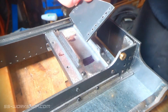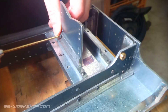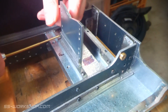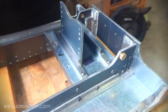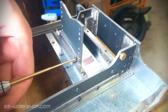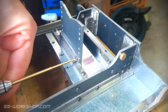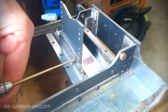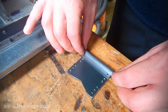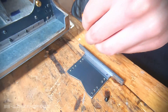The hole is complete, it's time for assembly. I've already bolted the frame in here and there's a piece of 0.5mm galvanised steel fixed to the underside of it. I then have my mounting angles fitted and these plates that I'm fixing now. I actually found it was easier to assemble these on the bench as there just wasn't access to get to the screws while it was in place. You may be wondering why the plate has a v-notch in it — the reason is to clear the centre rail.